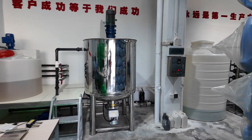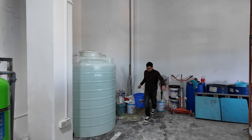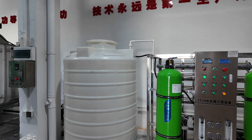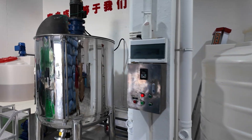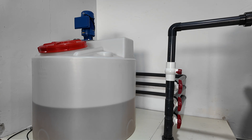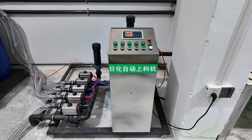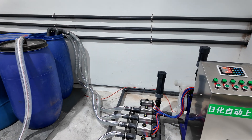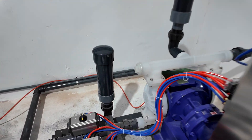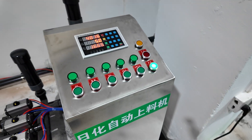Today I've come back to this customer in China. They are a small customer with a very small production line with water treatment. This is raw water, this is the water treatment, this is deionized water, and this is one small mixer and another small mixer for glass cleaner, floor cleaner, and stuff. Now this is the dosing machine, which is made of two parts: the scale, and the dosing machine itself, powered by this pump and this PLC controller.